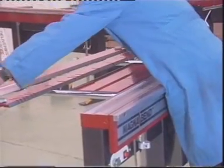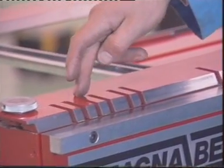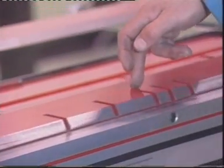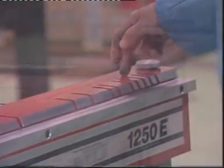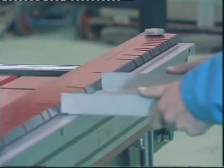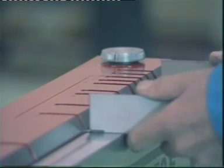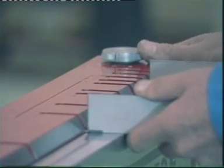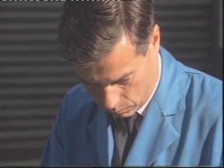An optional slotted clamp bar is available, which makes the forming of trays and shallow boxes very efficient. The positions of the slots have been calculated so that all sizes of boxes and trays can be formed. The size you want will be found somewhere on this bar. This tray won't fit here, but it will fit here. As the bend is formed, the sides of the tray pass into the slots. No adjustments of fingers are required, as on a conventional machine.